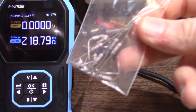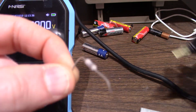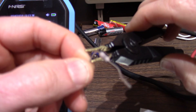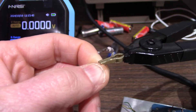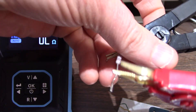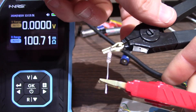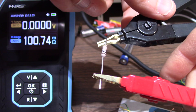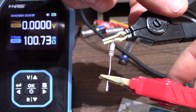Let's try these - the lowest value resistors I have on hand. These are 0.1 ohms, or 100 milliohms. Let's see what this thing has to say. And look at that: 100 milliohms, or 0.1 ohm. Spot on.